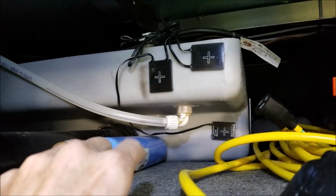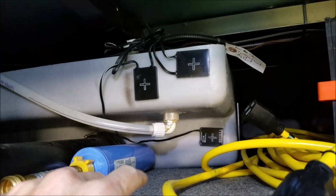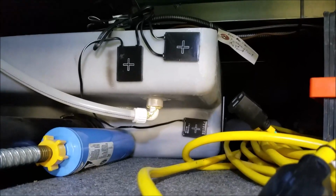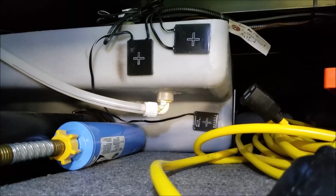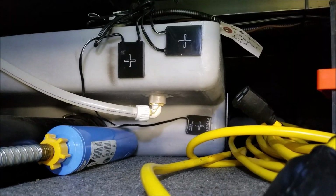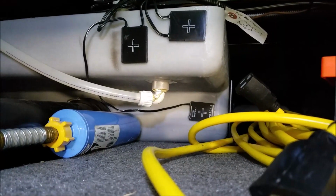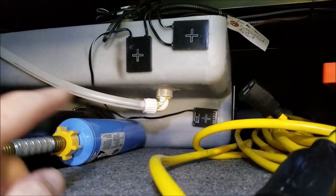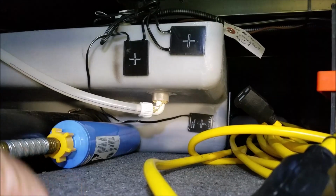So it's kind of a mystery to me. How do these actually work? So what they're doing is they produce what they call a small electric field. So it detects, and it's something called, let me think of that word, something called a dielectric constant. And so when liquid gets on the back side of that plastic, it senses that, and it works as the liquid comes up. Then these sensors notice there's liquid on the back side, and it changes the voltage, and the LEDs come on.